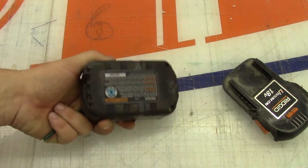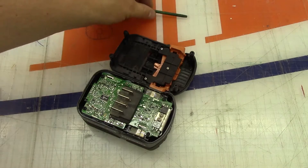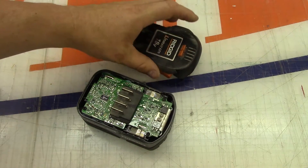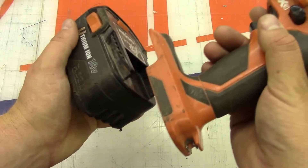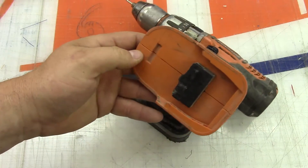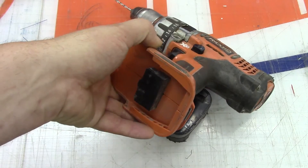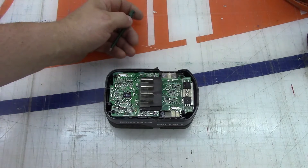They also have a 175 degrees C maximum operating temperature, so obviously a fairly good choice for something like this. There's a heat sink that comes down here, but it's completely passively cooled - there are two little vents in the bottom and slots on top. When you clip the battery into the drill, that actually gets covered up, so there's no forced airflow, nothing built into the tool to help cool it. There are two MOSFETs presumably sharing the load.